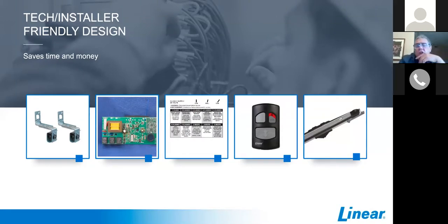The wall station on the right is our standard for our low-end AC openers and DC openers in the 800. They are all 3-button wall stations: light on the left, bottom up and down, open and close, and you see where it's got the red tab. That opener would be considered locked out. Locked out means it won't raise up from the ground with a transmitter, but it will work from the wall station. It will always close from the open position with a transmitter or the wall station, and then it shows the belt rail.